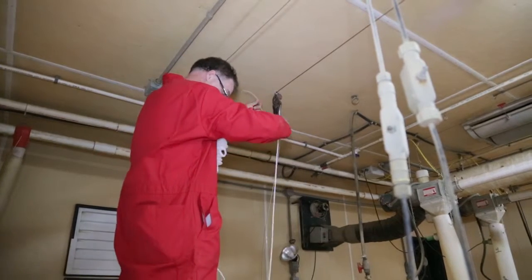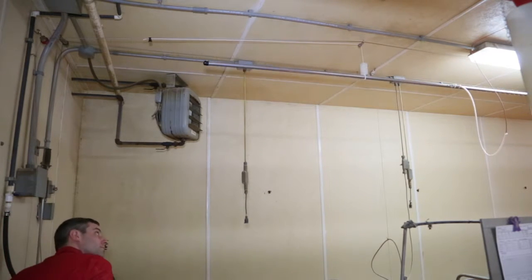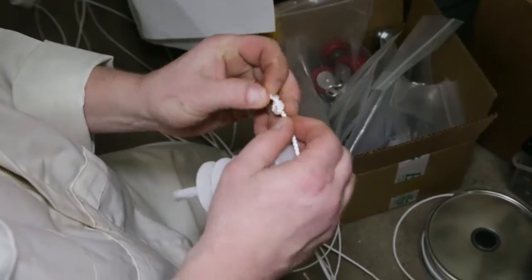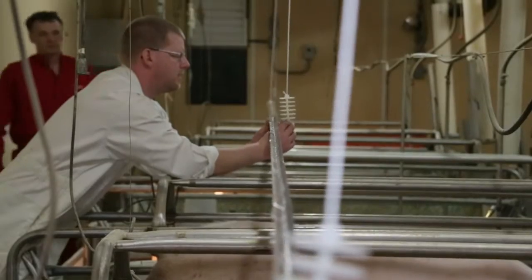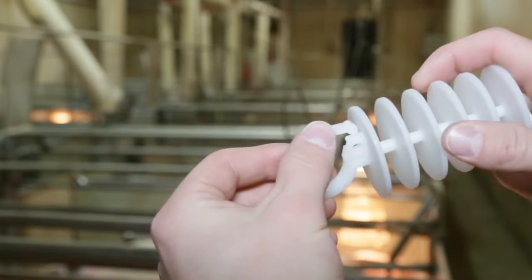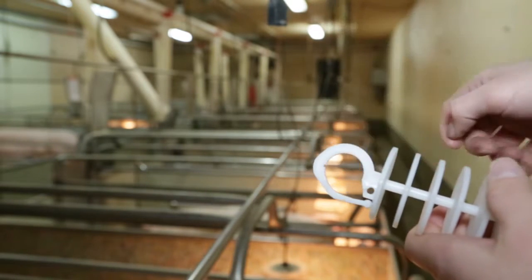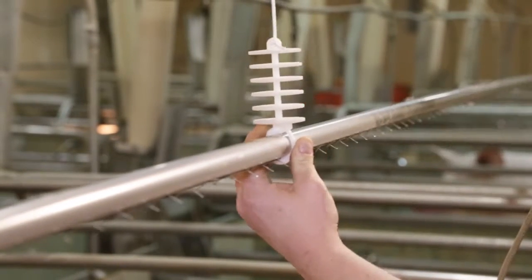Cut the appropriate length of rope to attach the corona pipe runs to the pull cable at each support location. The appropriate length will allow for the maximum travel up or down of each corona pipe run. Tie a simple knot at the end of each rope. Slip the untied end of each rope through the loop of the pipe insulator up to the knot. Attach the pipe insulator's circular end to the pipe. Each insulator should be attached to the pipe directly below the supports. Turn the pipe insulator so the clip side of the ring faces towards the pulley. The knot of the rope on the pipe insulator must be on the side of the insulator that does not touch the pulley. The small notch on the bottom of the pipe insulator should grab the corona point spine. Do not clip the insulator closed until certain no further adjustments are needed — once clipped closed, they cannot be adjusted or reused.